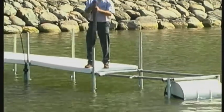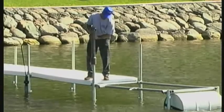If you are going to install a bench onto a 7-foot wide sun deck, you will need to take into consideration that the bench will hang 18 inches back, which will interfere with the vertical post. The pipe that is going to be installed directly behind the bench will be 18 inches shorter in length and rises no higher than 15 inches above the deck after you have driven it in and leveled the section. Notice the installer has turned the sleeve hammer upside down to pound down the short pipe.